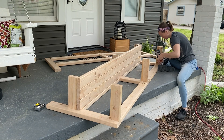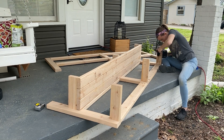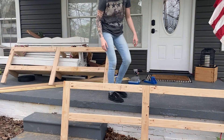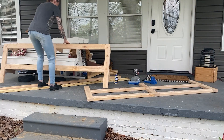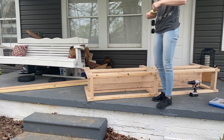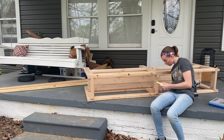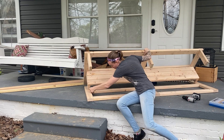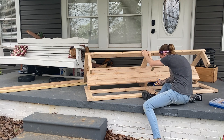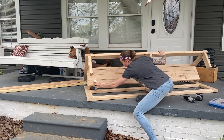I'm finishing working on the supports for the top of the TV stand, and once I do that I will be able to combine the back piece that I'm laying down here with this front piece, first making sure that I put glue on every surface so that it has the initial hold. Then after I finish putting the glue, I will grab my drill and continue screwing in all of the pilot holes.